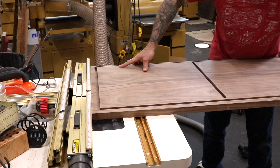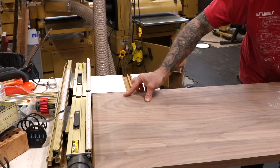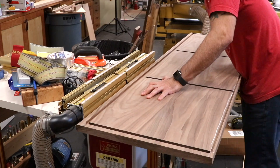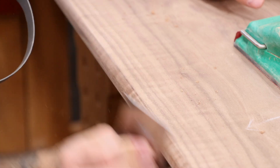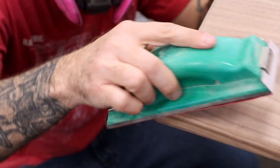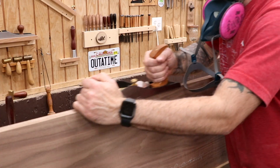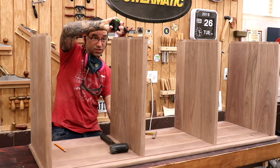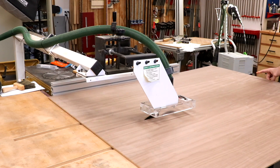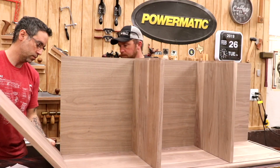Next I want to add a bull nose profile to the top and the bottom. I don't actually have a proper bull nose bit, so I'm taking two passes with a large round-over. The bull nose is added to the side edges and the front, but not the back — the back stays square. Since the bit doesn't give me a perfect bull nose, I'll finesse it a little at the workbench, then smooth the back edge with my jack plane. Once again we can dry-fit the case to measure for the quarter-inch back panel made from quarter-inch walnut plywood. We test the fit — if all the joints close, we're good to go.